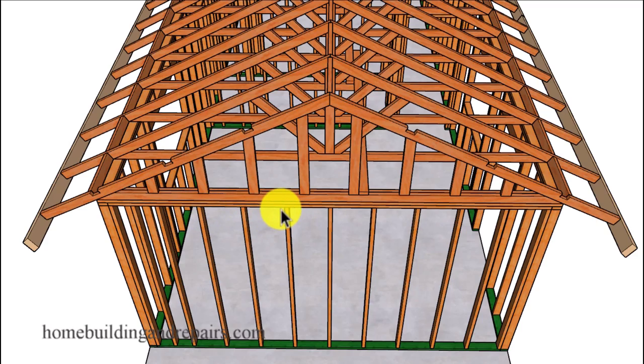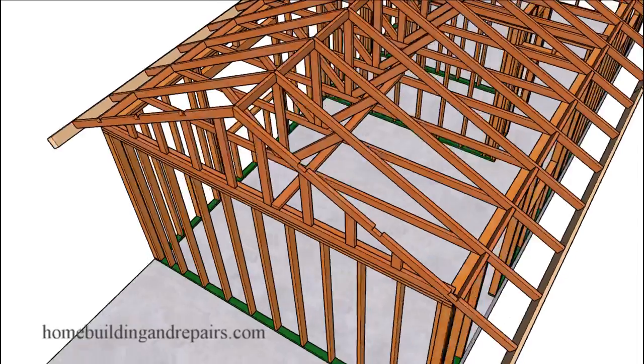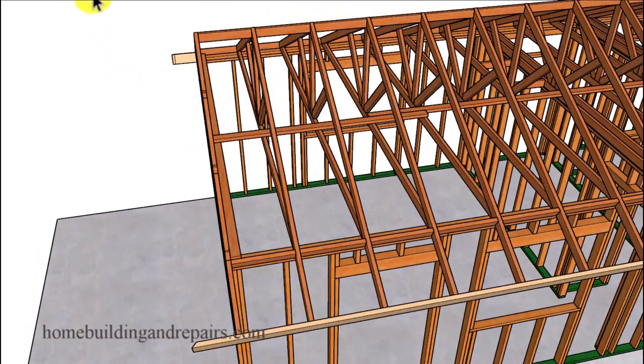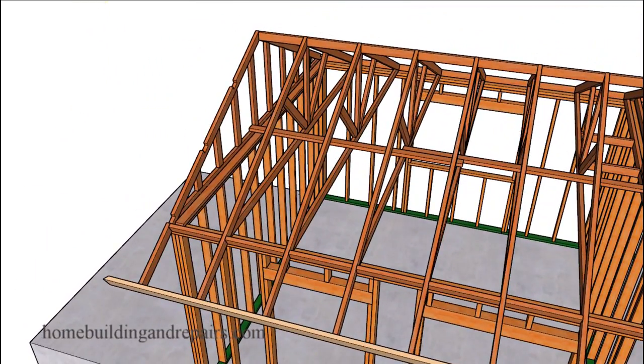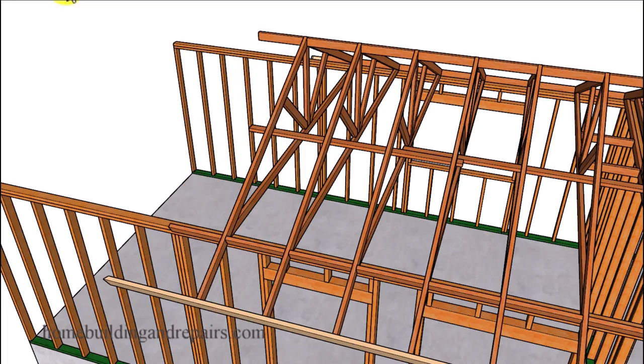So if you're going to put a door in here, just make sure that you have a header and of course something to support that section. This seems to be a mistake that is made by a variety of different people — otherwise I wouldn't be making the video.